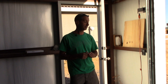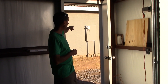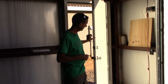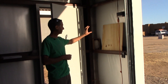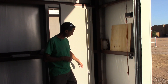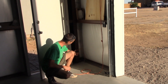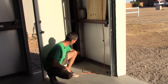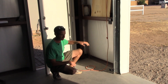Here we are inside the outbuilding. You can see through the door — that's basically where we were just a moment ago, so you can see our main panel there. What we're going to do is bring it down underground and bring it into the building, and then have the panel right here, which is near the garage door opener. Down in the corner — we did talk about this during the build — this is our grounding, called a Ufer. We have this already attached to the foundation, and that'll be part of the process of getting the panel installed.